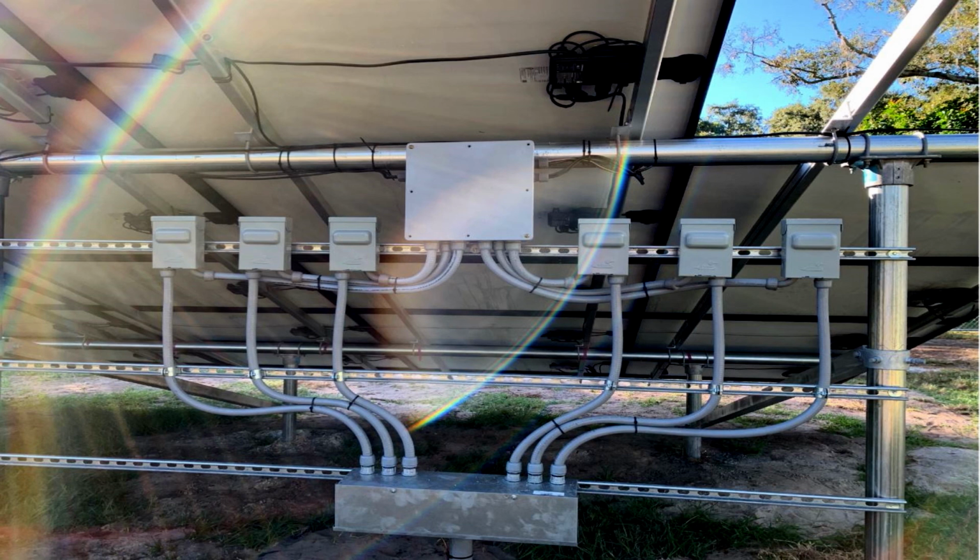So you have 6 feet in the ground of concrete with a 3-inch galvanized steel beam. And not just that, the beam actually has rebar on the bottom. On the very bottom of it, it's got 2 pieces of rebar drilled right through, so it actually has something to grip. Because if the concrete doesn't seat well around it, there's nothing really holding it. So it's got rebar on the bottom and then the concrete's poured on top. Those posts are in the ground. You're not moving those.